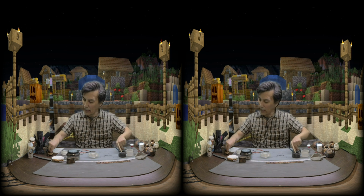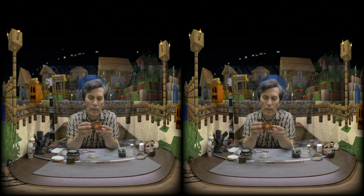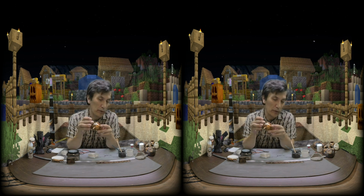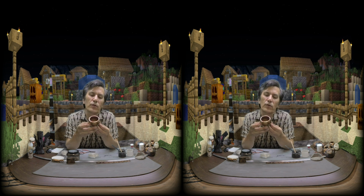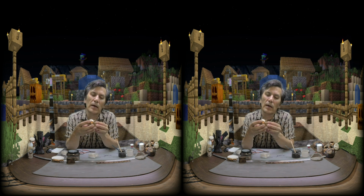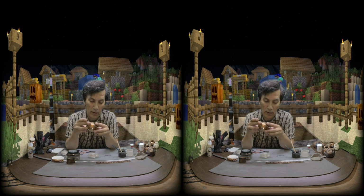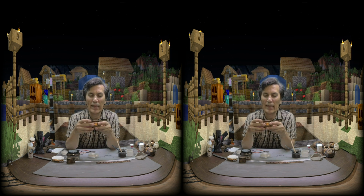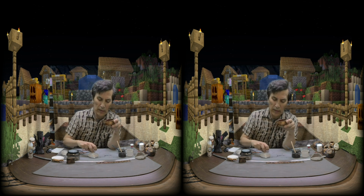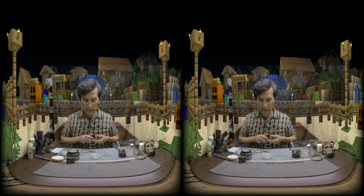So they go in the tank, and after about 18 hours, it comes out like this with the wire attached. And all you need to do is simply remove the wire, and now you have a copper vessel which you can add a patina to, or add to different types of creations. If you're adept at removing the PLA layer, go right ahead. I will cover that in a different episode.